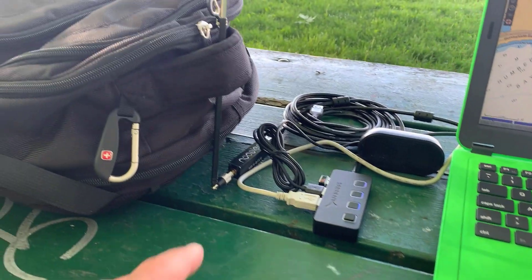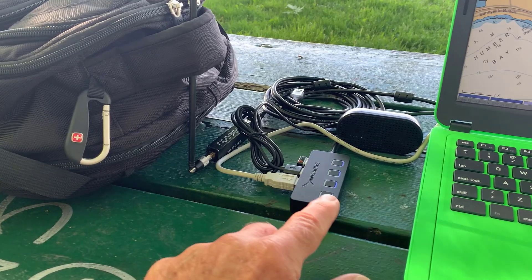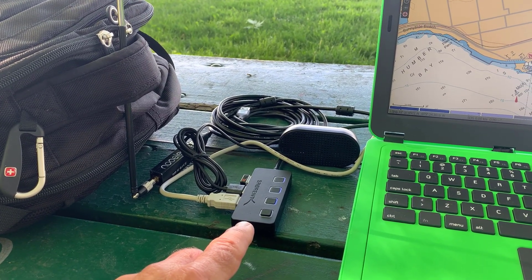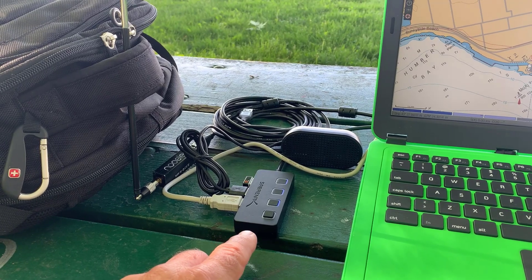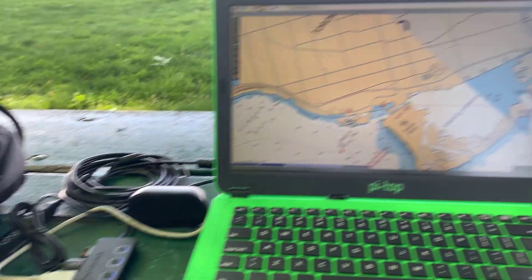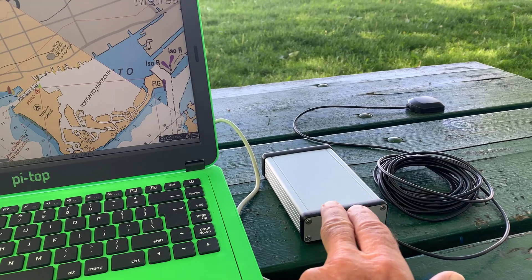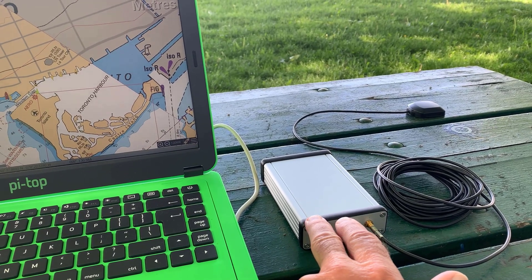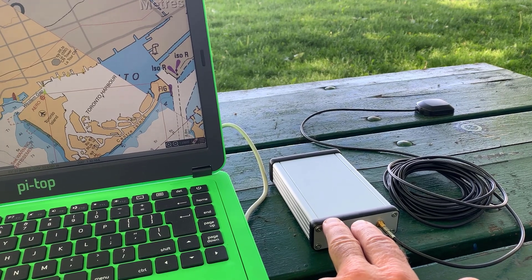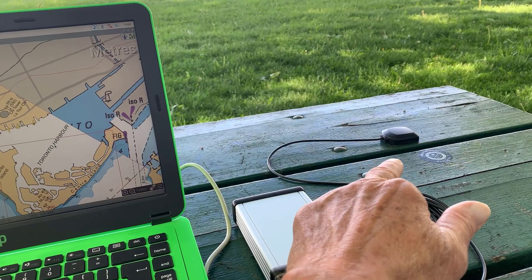Right now I'm using an RTL with a whip antenna for my AIS. I've only got two USB ports on the Pi Top, so I've got a USB hub here and I'm running a USB speaker so we can listen to GQRX, and there's my GPS. This is an old kit I made — it's got a 12-channel Trimble IC in it and an FTDI USB driver, and there's the LNA patch antenna.